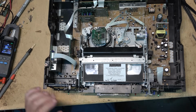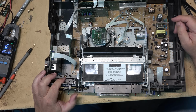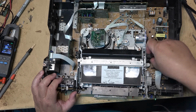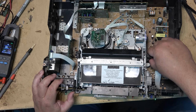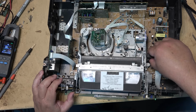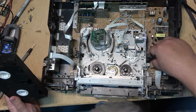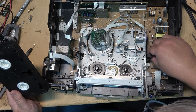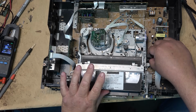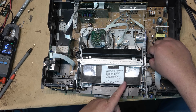take-up sensor on this side. So that means I got to pull the chassis again and give an inspection to see if it's come unsoldered from the board. That time it worked, so I have a sneaking suspicion it's a connection problem because it didn't jam that time. Now it winds forward.